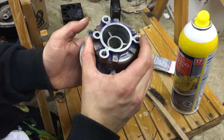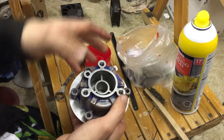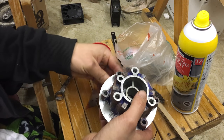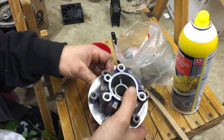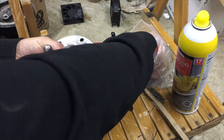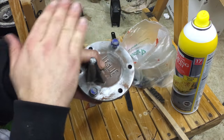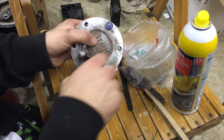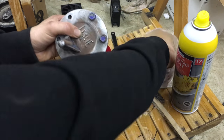Then after that, we're gonna assemble this power chamber all back together. Grab our bag of bolts, align the holes. I'm gonna put one upside down, so you gotta play fishing with it. But once it catches, you gotta keep her. Then just hold it together, flip it over. Try not to let the power chamber and back cap slide on each other. So I like to do opposites. I like to put all six bolts in, just so I can get a nice even clamping pressure.